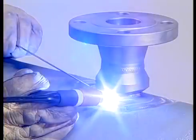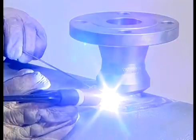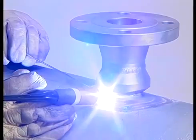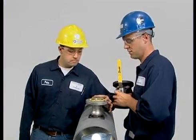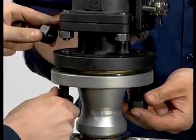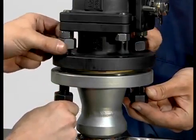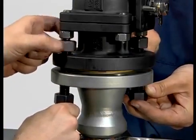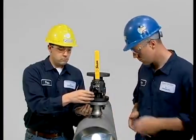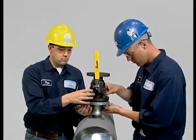Since the pipe is in service, no hole should be drilled in this pipe until after the flanged assembly has been properly positioned and welded in place. You can then install an isolation valve. To do this, position a gasket on the mounting flange and place the valve onto the assembly and fasten it to the flange with the supplied nuts and bolts. Check that the gasket holes are aligned so the bolts will pass through. Be sure the valve stem is positioned in line with the pipe so that when the flow tap is installed, the insertion rods will straddle the pipe and the valve handle will be centered between the rods.